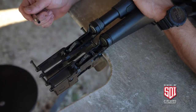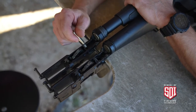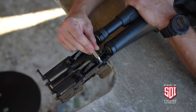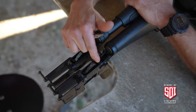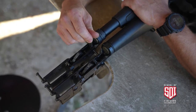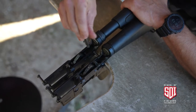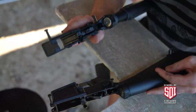On the right here we have a semi-automatic AR-15, and on the left we have our full-auto. There are a few differences as you can see. On the semi-auto, this portion of the receiver is blocked off — added material to prevent you from adding a full-auto sear, which is this part right here. On the full-auto, it's all milled out to allow that sear to operate freely as the gun is firing. Additionally, there's a little pocket back here on the semi-auto receiver — again, added material to prevent you from adding the sear and disconnector needed for a full-auto firing group. It's just milled out differently, and the actual components are slightly different as well, as I will show you here in just a second.